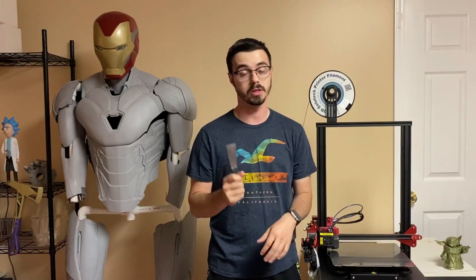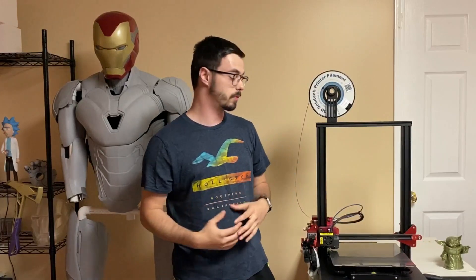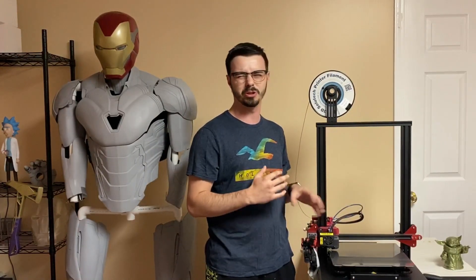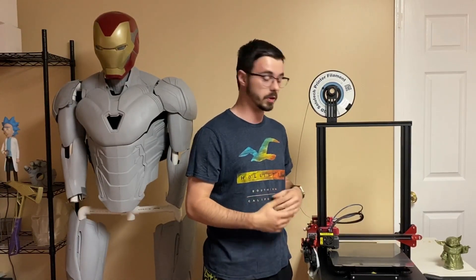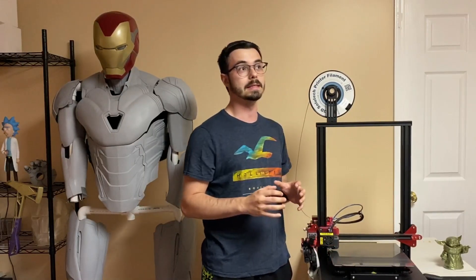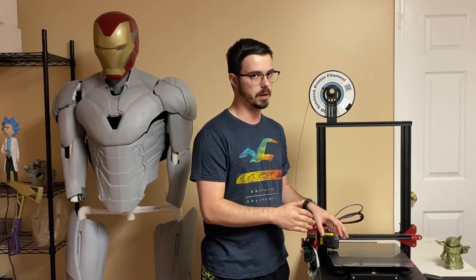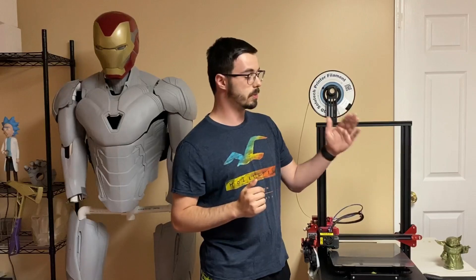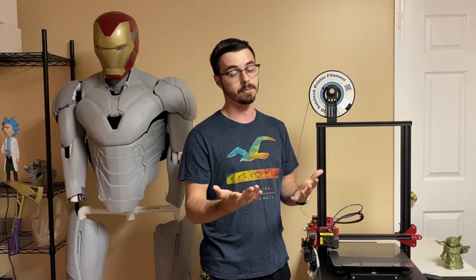Gone are the days that I use the stock plate. Now, this is not a wham-bam review video at all, although I'm doing a video on just installing it and what I think of it, and some tips and tricks. It's not actually a very straightforward thing. Installing it is very simple, but the problem is this material that it's made of is not very good for adhesion, and it's very difficult to calibrate well. So you need to make sure your bed is leveled. The first problem I had is that build plate just destroying itself — and that's something you want to look into.